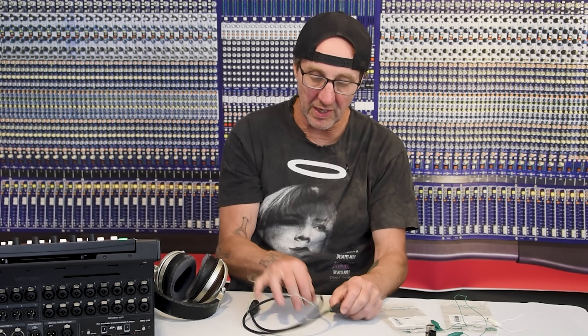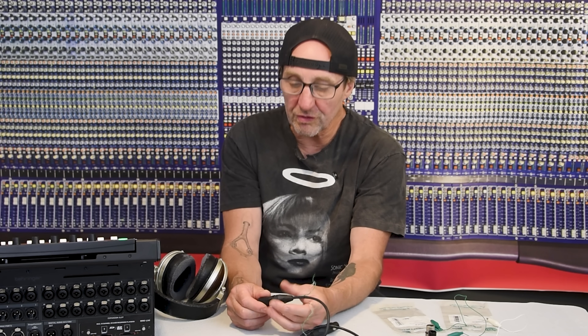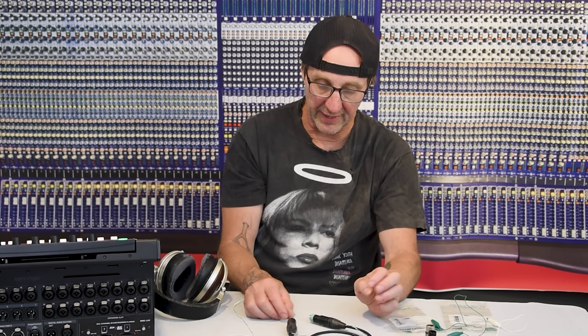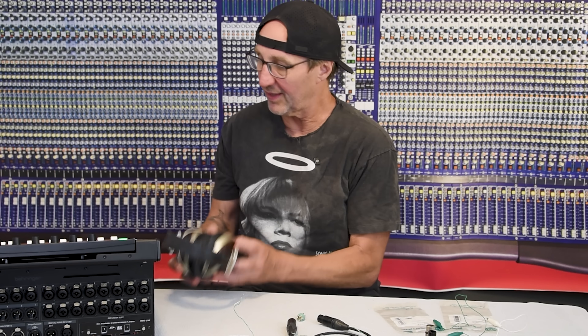I've made two cables here. I've connected a white wire to pin one and a green wire to that little metal tab on the inside that goes to the metal shell and allows the conductor to touch. There's the little metal tab with the green wire, and the white wire is connected to pin one. This will allow us to ground the shell manually and listen to the difference. There's a 200 ohm load that will stop it from being super noisy so we can actually hear the noise instead of having the mic cord act like an antenna.